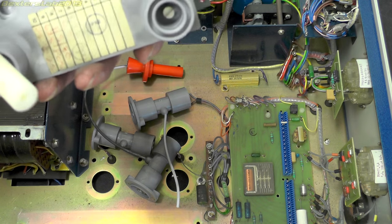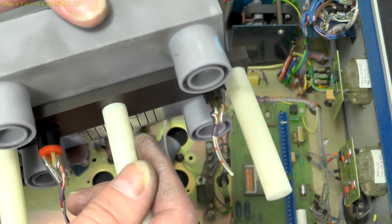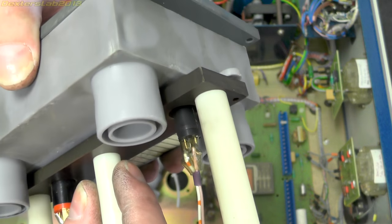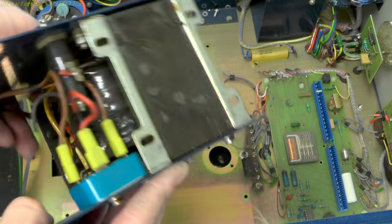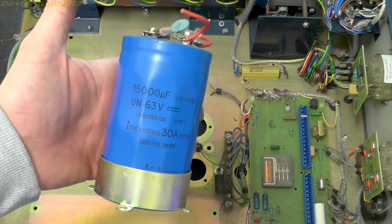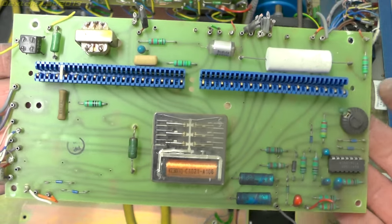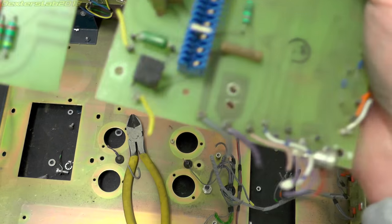There are little holes in there for the switches to either push against or be bypassed. This switch here is definitely pushing against that one but that one is not. So this is the main transformer - literally just a transformer, bridge rectifier, and that inline fuse. And here we have the main storage capacitor: 15,000 microfarad at 63 volts.